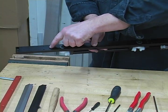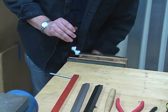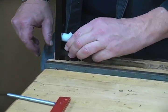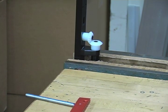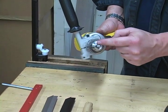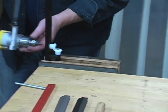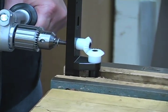We're going to get the long side — this oval hole — going up in our vice. We're going to position this so that none of the gears or the shaft are hitting anything. Then we'll get our electric drill. If your chuck jaws protrude past the face of the drill chuck, you may want to put a washer on there to keep them from gouging into the top of the bearing. Start the screw in here and you're going to want to burn this for about three minutes.